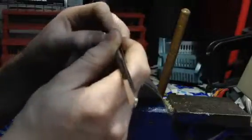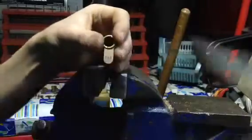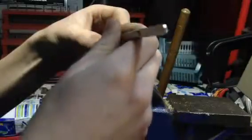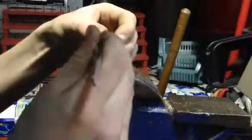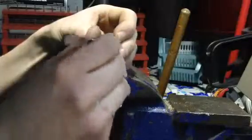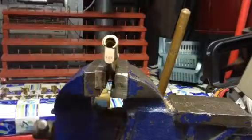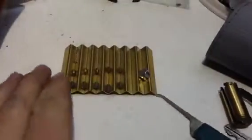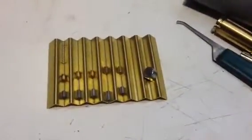We remove the springs too because when you put the lock back together, it's a real nightmare. Again, another spool. A third spool. And 2 standards, but we'll remove them to show them. There we go. So, three spools, 2 standard, and all standard key pins.